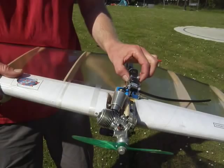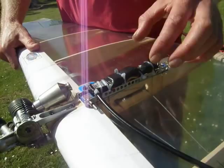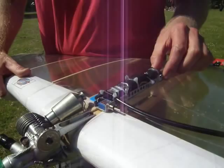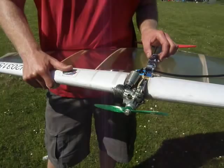Then it can move in the top one and a half millimeters, and there's a micro switch to detect this one and a half millimeter movement down here. You can adjust this one and a half millimeters — that's when the line tension is there. The regulation of the line tension is here; I can regulate how much line tension I want. This system switches off with ten newton on the line tension.